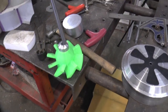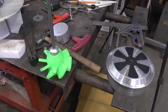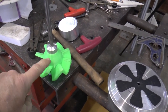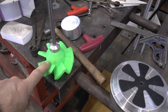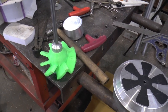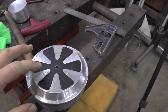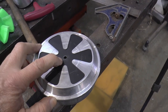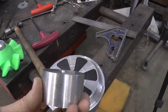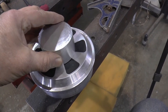So I've got to come up with set screws and a way to hold this into the plastic piece. I think I'm going to probably epoxy it and maybe put some screws up through from the bottom, and set screws of course. I got a little bit started on the hub — I have a hole drilled right here in the middle, did it in the lathe of course. And I got this piece of aluminum turned; you can see a little nub on there and that is to center this, like so.